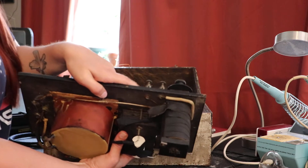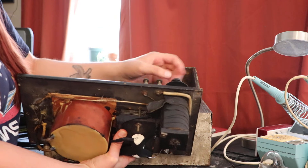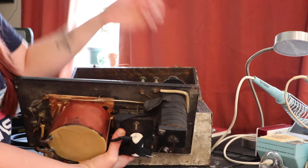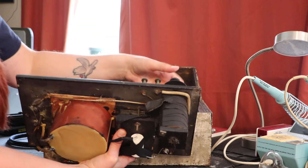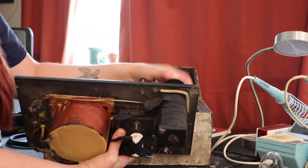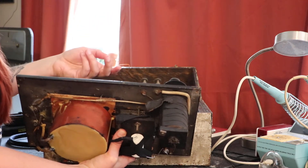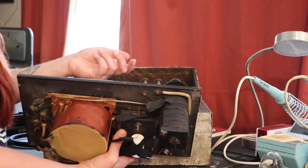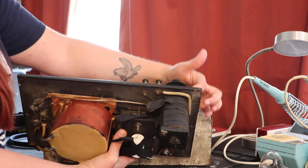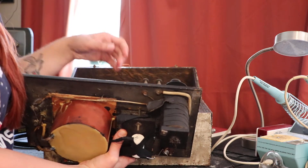This here is the kicker coil — it's an electromagnetic interrupter. Your two contact points are here and it's got a spring. This is actually an interrupter design that's kind of unique. I don't like this design personally; it's intended to be self-cleaning. The top point is actually loose, and the idea is it rotates and burns off any oxidation. But what really happens is you get a buildup of oxidation between the screw and the point, so I don't think it's a very good design.